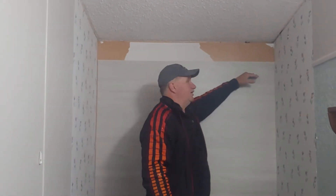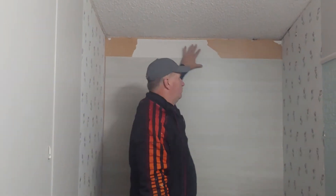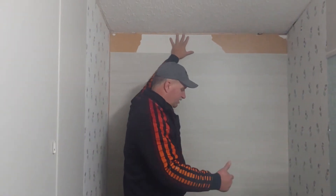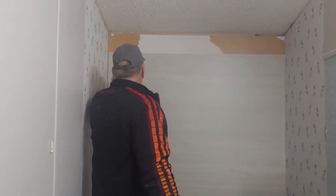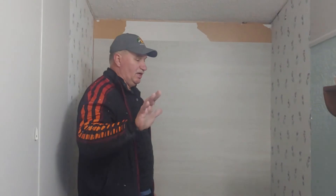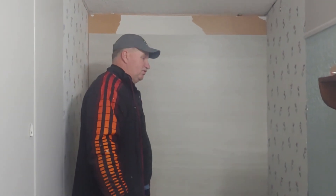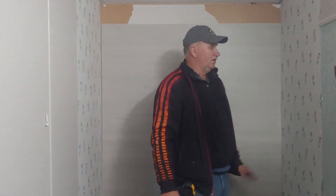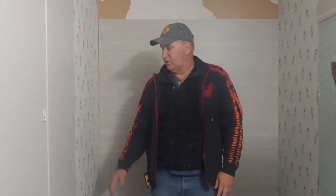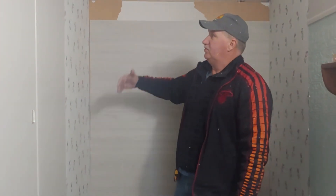So I want to let you know — we have this gap up here. That's not going to be normal if you have a tub-shower. A tub would even be higher, so you would have to cut this top panel again. You could cut it with a razor knife and snap it, or use a skill saw and cut across. The customer wants to leave this gap up here, not down at the bottom. This is going to be a cast iron tub in a mobile home — it's not normal, but it's really cool.